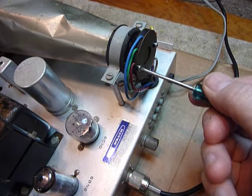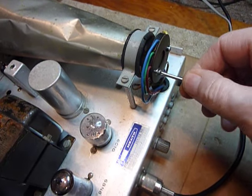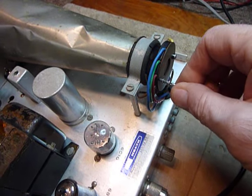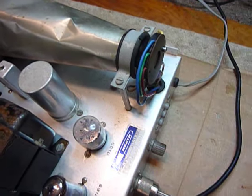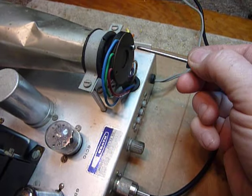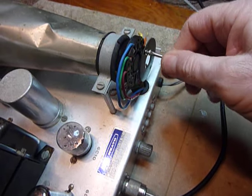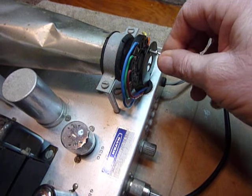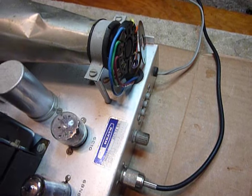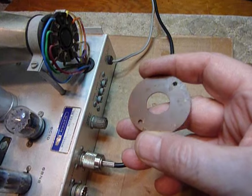But what I did — there were two little hollow brass rivets that held this back piece on. I thought I would drill that out and clean in there, which I did, but it still had the problem. I cleaned the little back piece, but I did notice that with the back piece off it did not do it anymore — so it is the back piece.